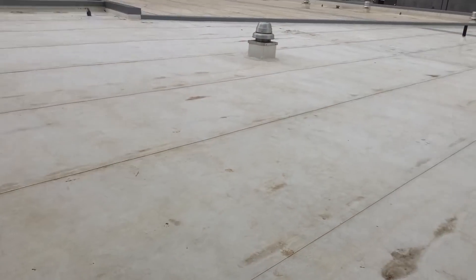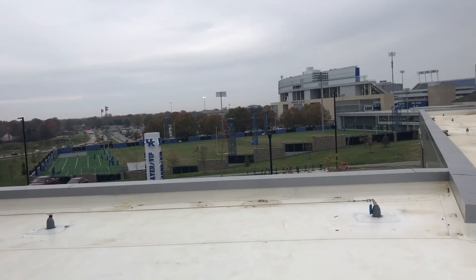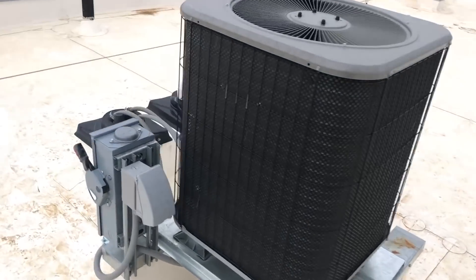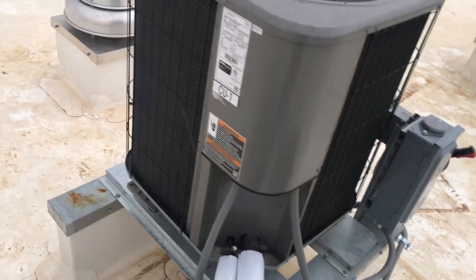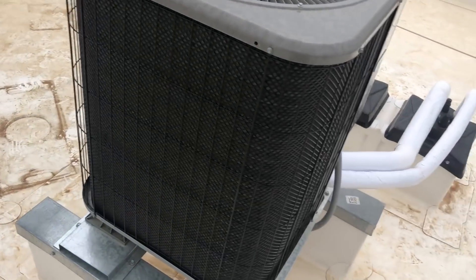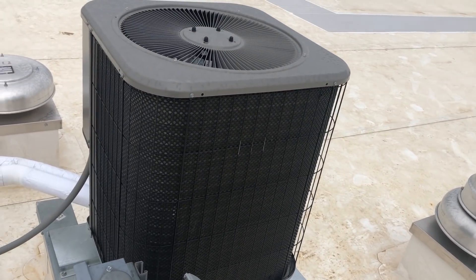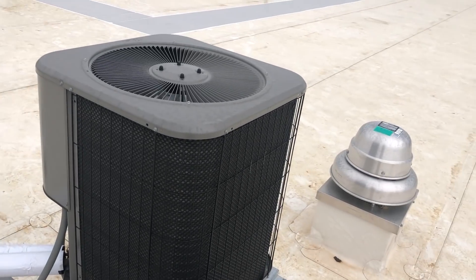You've got to be kidding me — we got the sleet starting. November 12th. Here's our little chiller condensing unit; really ain't nothing to it. Good to see it's got fan cycle control. That's one thing I was wondering about, making sure they did remember to install and include. Since this is a year-round application for the cold baths in physical therapy, this thing will need to run and maintain head pressure throughout the winter.